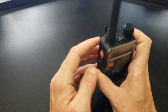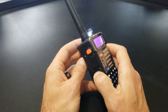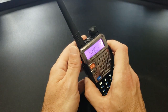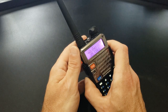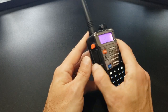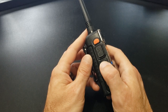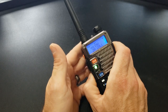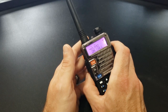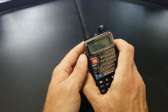The MONI button — if you push it once for a short press, it'll turn on the flashlight. If you push it once again, it'll do SOS. Push once again to turn it off. A long press of the MONI button will give you the monitor function, so it'll bring the squelch down to zero. That way, if your squelch is too high or someone's really deep in the noise floor, you can still hear them.